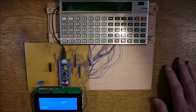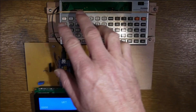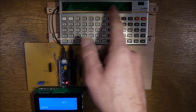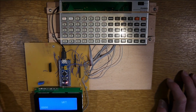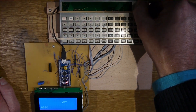The Blue Pill is just running an Arduino sketch written in C/C++. It uses interrupts so that the bus sniffing is done on the chip enable for the display chips — when the chip enable goes low, you get an interrupt and that bus cycle is captured and processed by the ARM processor. The display is a standard 4×20 LCD. The 702P's display has some dot matrix characters, four seven-segment displays, and a few annunciators. The top line of the 4×20 becomes the dot matrix.